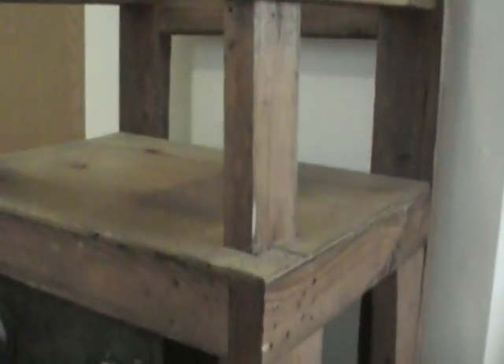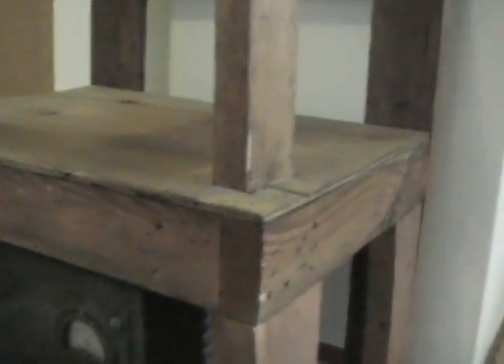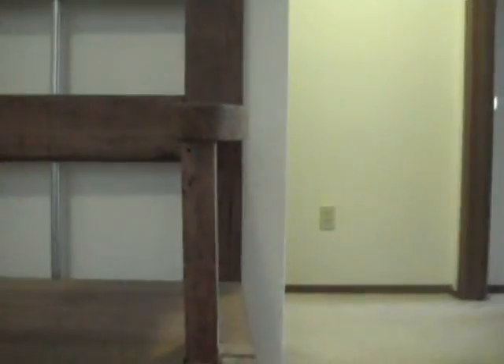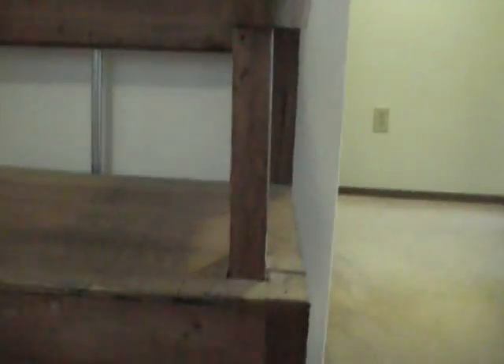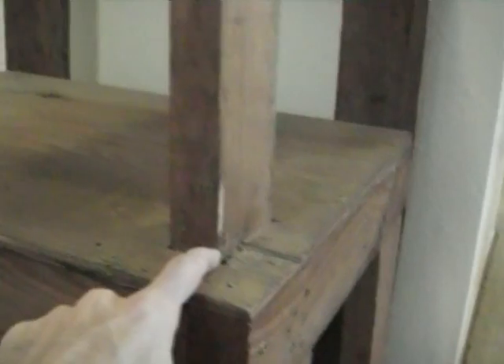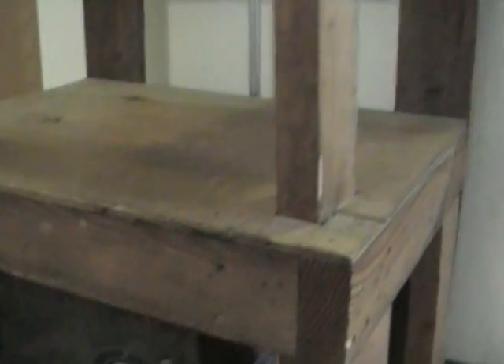This front piece here is 29 and a half inches — it's a 2x4. The back piece is 51 inches. You cut two of those and two of the front pieces and put that together. What I did here was, instead of putting this piece at the end, I put it in a couple inches so it would be lined up with that back piece, which meant I had to cut a hole in the plywood and put the plywood seat on before I put the arms on.